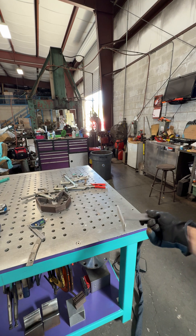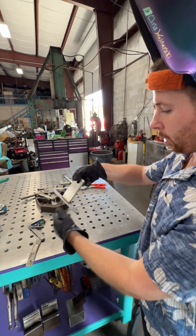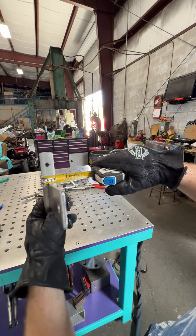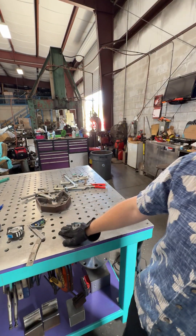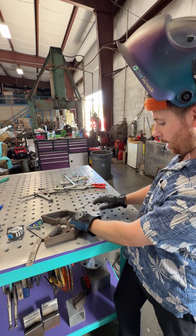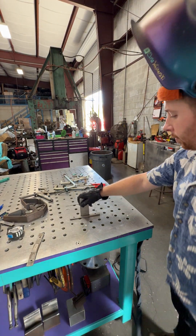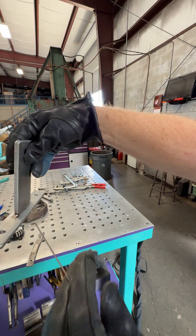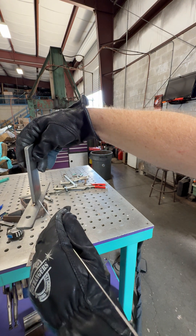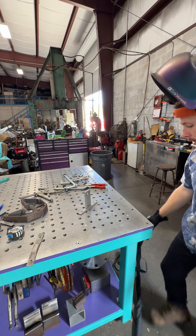Another way you could have done this too, even with the Fireball Tools, is put it down flat and shim it up. The way this was spaced off — this is one inch, so I think it would be three-eighths — that was my distance from each end. So if I would have taken three-eighths shims, put it down, laid this thing flat, and put this up to the side and clamped it somehow, that would have been fine too. I like to make sure I tack the sides and wrap the sides after welding — I want to make sure I don't end the arc right there and leave the sides unwelded. Wrapping them makes it extra strong.